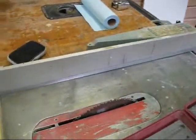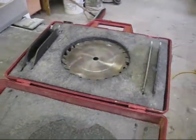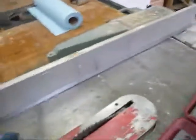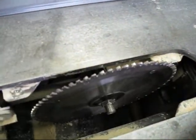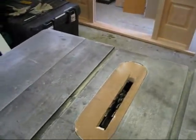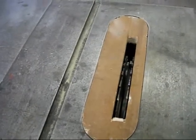Now it's time to change to a dado blade. You can see how skinny that blade is. This is my dado blade kit — it's a stacking dado blade kit. I've got to lift this thing off of there, undo that bolt, and set it up to the thickness you want. I've got the dado blade on there, as you can see. It's 3 quarters inch wide right now.